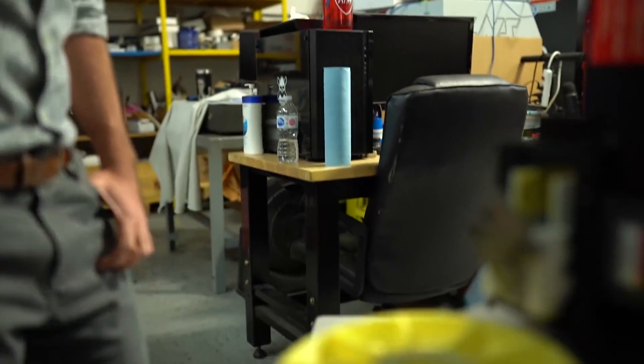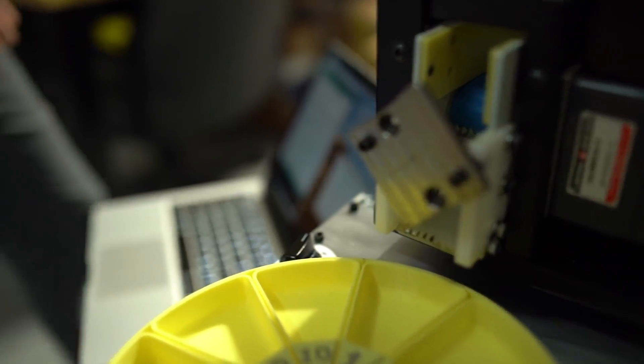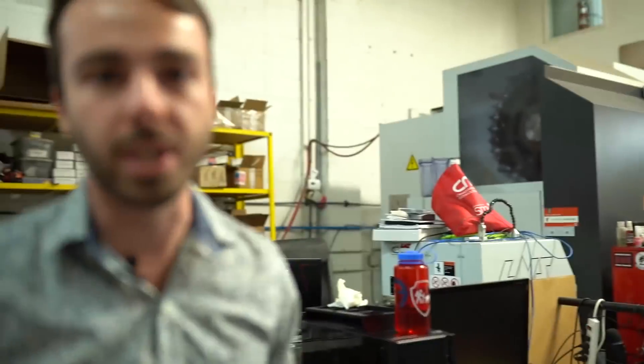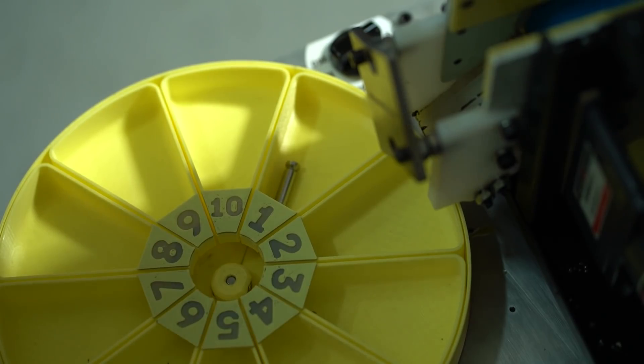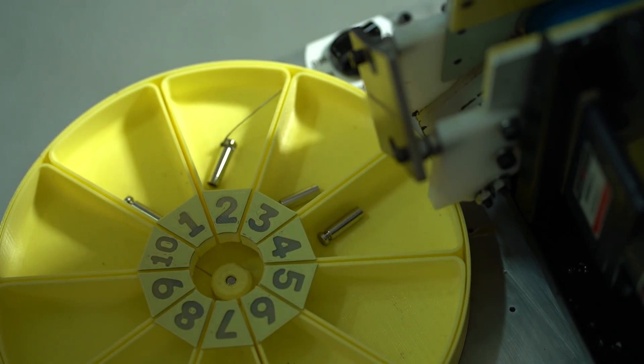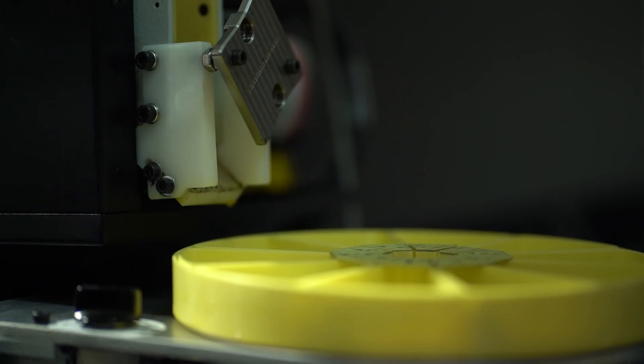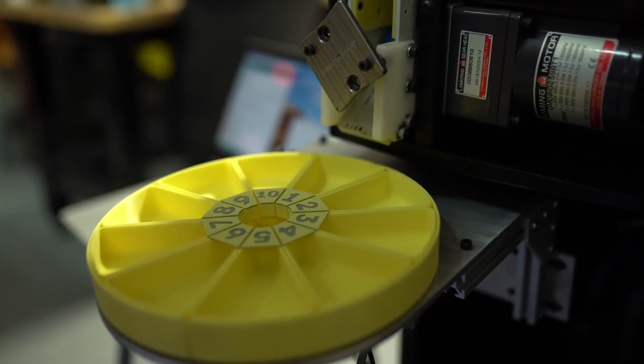It's Marcus, and this is day two on the parts carousel build. We just did a little bit of calibration and coding work, and we got it working really well with the lathe. Right now it's set at the first bin, and the switch is at one part per bin. We're going to hit the go button on the conveyor. As soon as you hit go, you can see on the screen it's got one activation — it records that and then does a countdown. The conveyor belt goes on for 45 seconds, so we set a 50-second delay. It counts out those 50 seconds and ignores all input during that time, because it's an AC motor running at 60 hertz, so we'd get 60 parts per second counted — which is obviously not what we want.